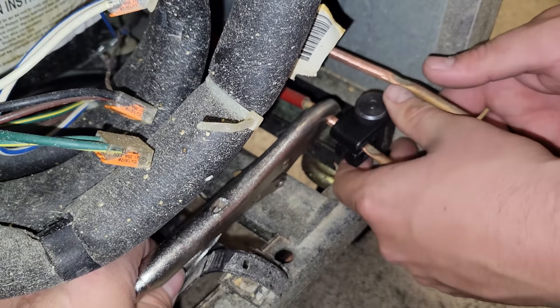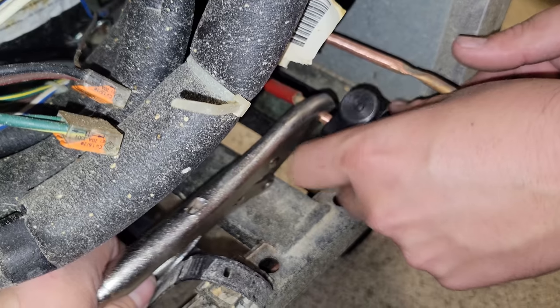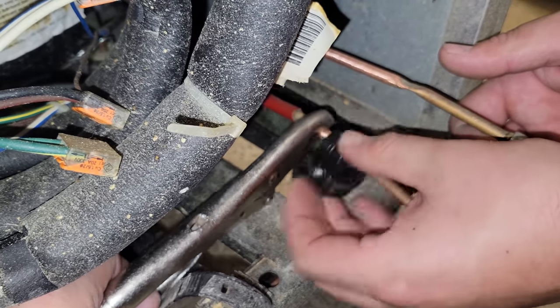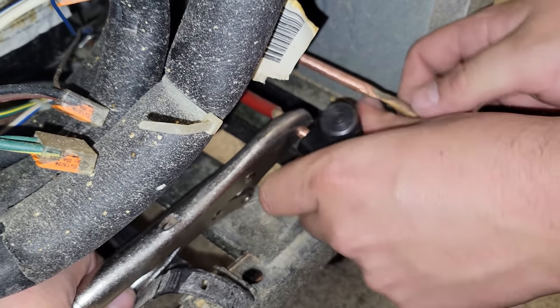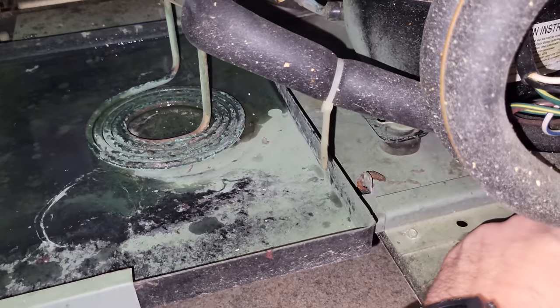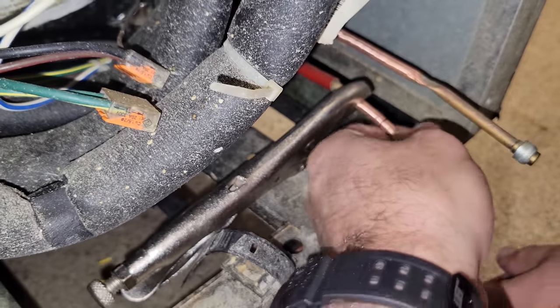This is weird. I was thinking about something else too. It's always possible that maybe the defrost heater was running too, but the ice pattern felt weird to me. It was frosted up more towards the bottom where the heaters were at, so that doesn't make sense. It might be low, but we're not picking up any leaks. We did a quick leak search on the evaporator too, and we're not seeing anything, so it's interesting. Should snap right off.